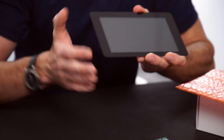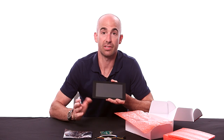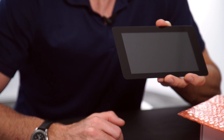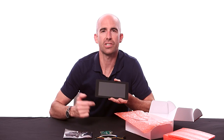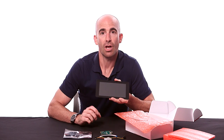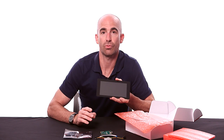This is a pretty great display. You can find all the technical specs online, but just to give you an idea of the capabilities: the screen dimensions are 194 by 110 by 20 millimeters, which includes the standoffs. The viewable screen size is 155 by 86 millimeters. Resolution is 800 by 480, which gives you a real nice display for all your Pi projects. Also, touchscreen drivers with support for 10-finger touch and an on-screen keyboard will be integrated into the latest Raspbian OS.